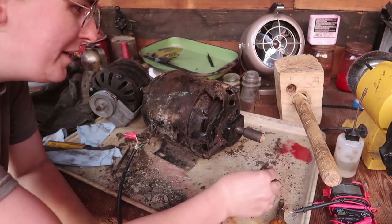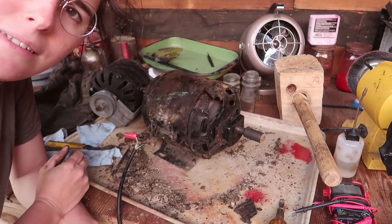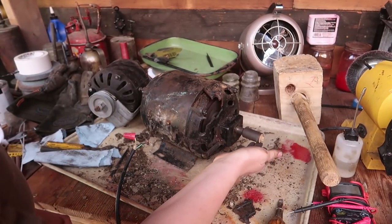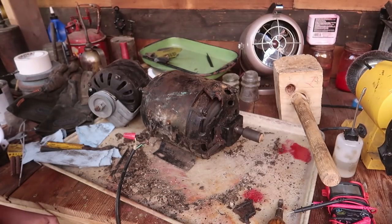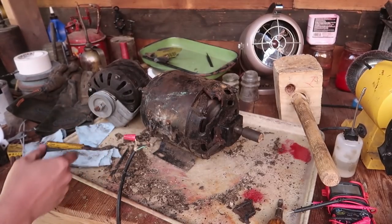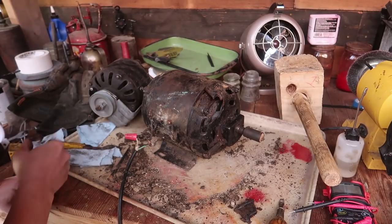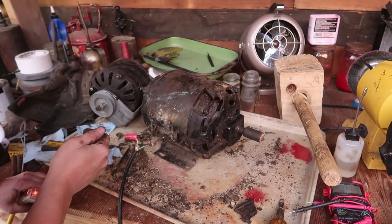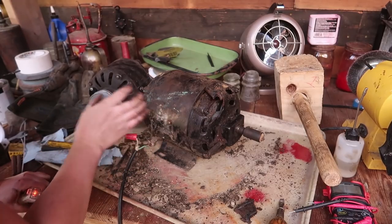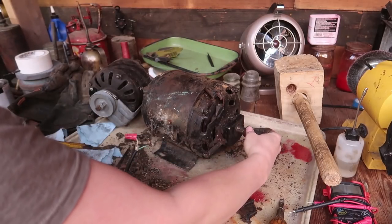And it'll be a nice little job for brazing. Oh, it is the full piece pretty much. Well, that's nice. I'm happy with that. Well, I'm not happy with the wiring, but you know. So we should do a restoration of this. We should trace back these wires that go back to the coils in there, the windings, and we should replace these wires. If I can't fix that little box, we'll get another little box to put on there. And we have ourselves a nice little 1-horsepower motor or something.